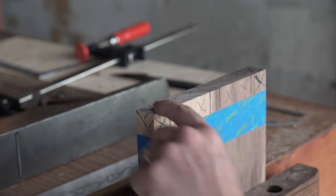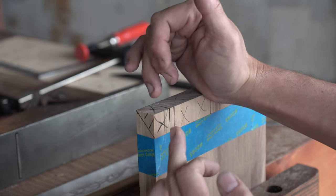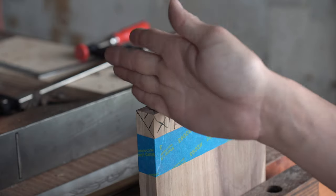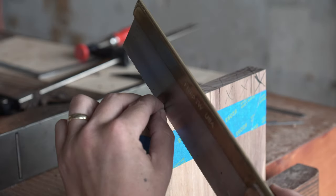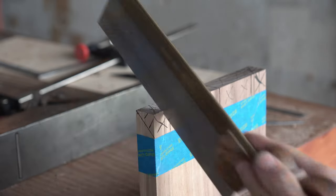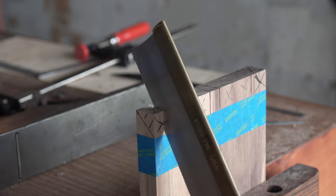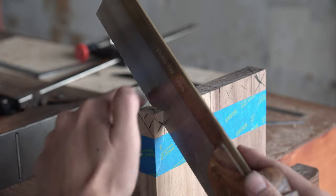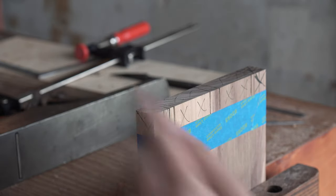When it comes to this weird pin miter socket hybrid combo, essentially you want to make sure that you do not cross over. You're gonna treat it almost like you treat a half blind dovetail. Instead of cutting down, you wanna come in at an angle and stop before you cross into your face. So just like that, making sure that I am into my waste. And I'm tilting my saw sort of towards me and down to make sure that I'm staying up. And once I hit my baseline, then I can kind of worry about the top. And that's probably close enough.